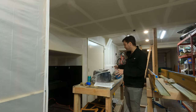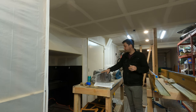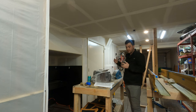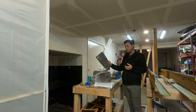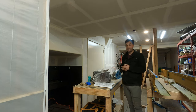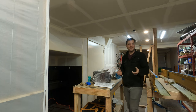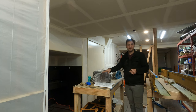And these are the ribs, or the pieces of the ribs. 54 pieces in total, about. We have forward ribs and aft ribs. Together they would make one whole outline of the airfoil, omitting the aileron or flap at the back. All of these need to have the flanges straightened. They need to be fluted or straightened because there's warping from the machining process. They all need to be deburred. And I imagine it's gonna be quite a lengthy and tedious process. So, that's where we're gonna stop today. I'm gonna get to work on these, and hopefully soon here, I'll have an update with these nearly complete.